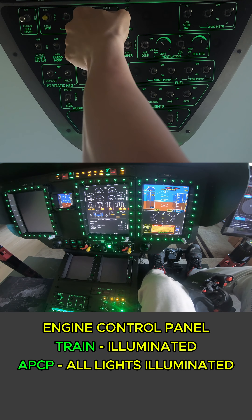It is stable. Let's go to system number two. We should be looking for on the message center hydraulic one low pressure and hydraulic one TR shutoff, which we have. We're waiting for this to go down all the way - there's zero, and then we would be checking our forces. We're going to move this back to the off position.